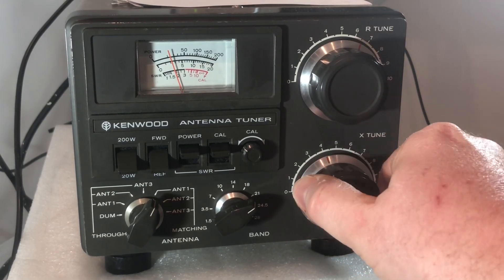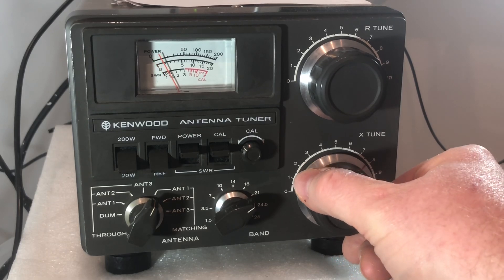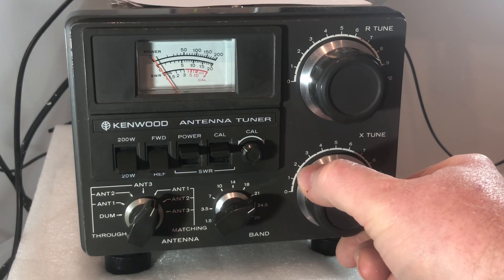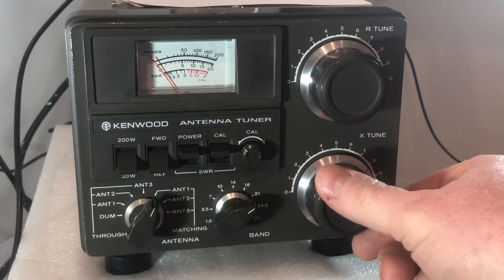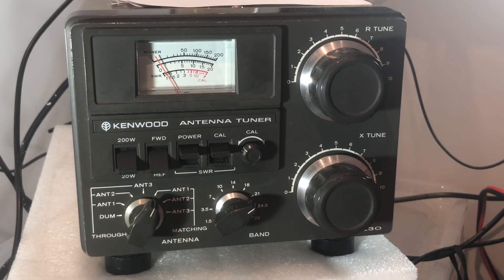Nothing doing on that one. Try the reactance dial. Now we see a dip — that's good. Let's see how far down we can bring it. Looking at the SWR meter on the rig, it's now not showing any SWR at all — so that's a good start. Now I've de-keyed the transceiver. Next, we turn the power up. I'm going to select maybe 30 watts, check the frequency is clear, and transmit again. Not looking too bad — slightly more reflected power, but basically a zero SWR reading on the Sentinel 300.